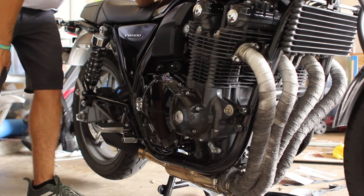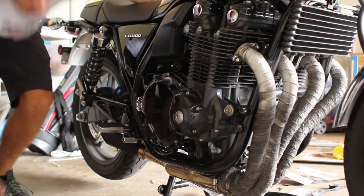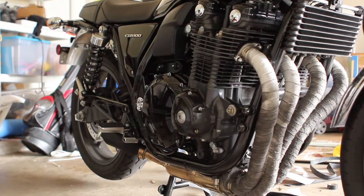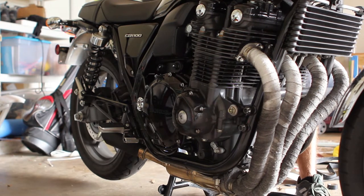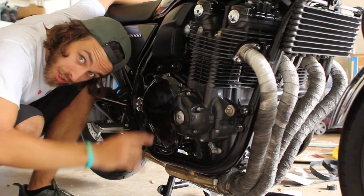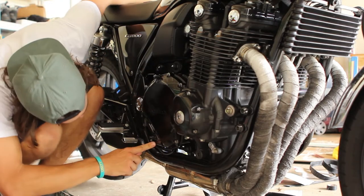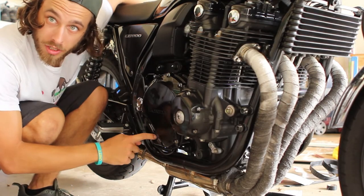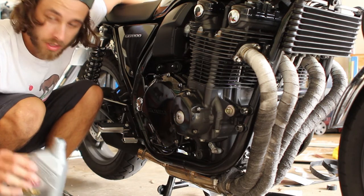Alright, let's turn it on and run it for a minute or so, then we'll check the oil levels again. I'm going to crawl down here to see the camera — I'll let it sit for a bit. I still don't really have any indication in the sight glass, so let's fill it up a little more — we only did three and a half.